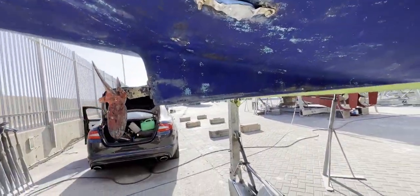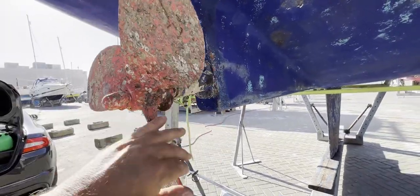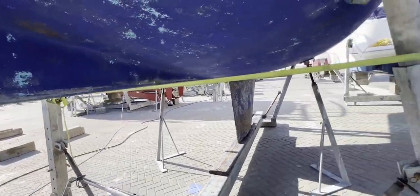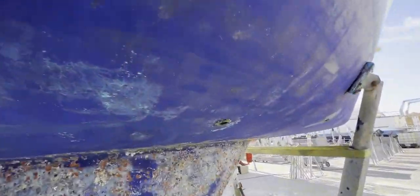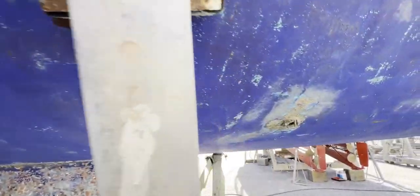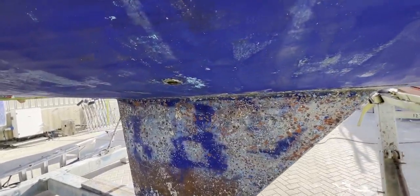Why would it do that job? On our boats we may have metal underwater, and generally on boats this will be bronze — like what lots of propellers are made of — or it could be DZR brass, which is what a lot of the underwater fittings are made of. You can't see the brass here as it's covered in growth and paint, and this one here is ready to be cleaned off. We don't want that to corrode.